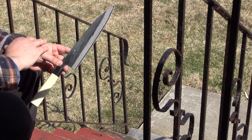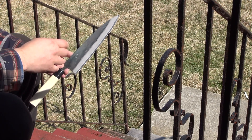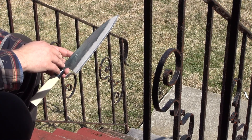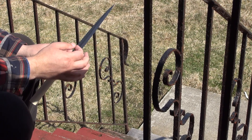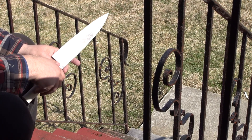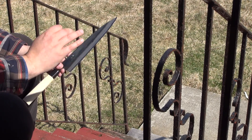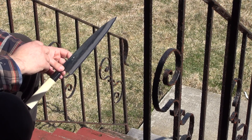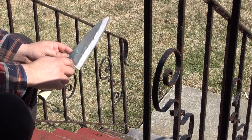As a side note, this is white number one steel, often called white paper steel — essentially a very pure, high-carbon steel. These knives often confuse people the first time because they feel very sticky and come relatively dull. That's because they're coated with lacquer, since the blade has no corrosion resistance and would rust during shipping. Trying to use the blade as-is makes it stick to everything in the kitchen. Normally you just clean the lacquer off the blade, then use a four-to-eight-thousand grit finish stone and very lightly grind the lacquer off the edge — and the sharpness is there almost instantly.